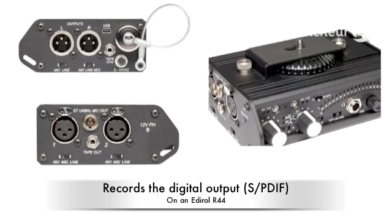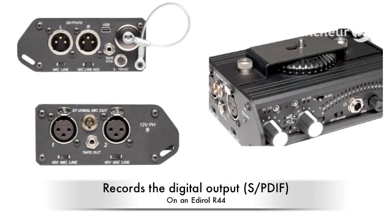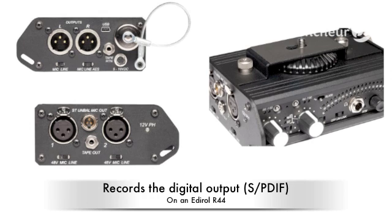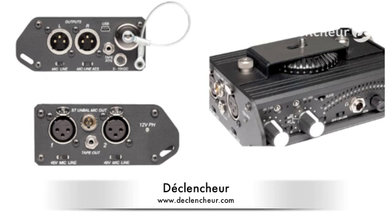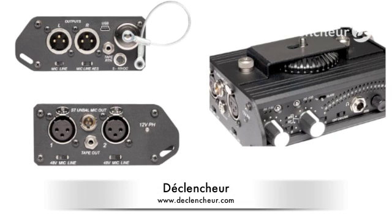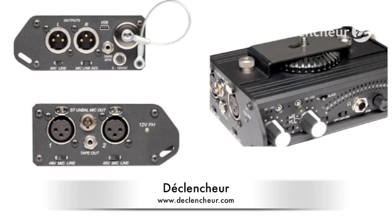I must tell you that when I connect my MixPre-D to my DSLR, there is more noise, simply because the DSLR doesn't have such a high-quality input and therefore it degrades the audio somewhat. In a scenario where you really want top quality, you would want to do dual recording — and this is why it's so nice to have so many outputs on the MixPre-D. You could send one signal to the DSLR and at the same time have another signal going to a high-quality recorder. Even so, having a field mixer like the MixPre-D gives you more flexibility and allows you to prepare the sound so it's better than plugging the microphone straight into your DSLR.